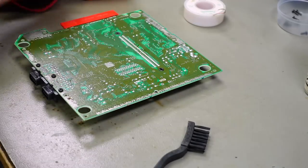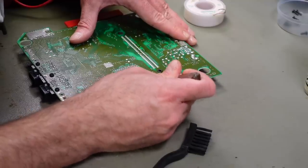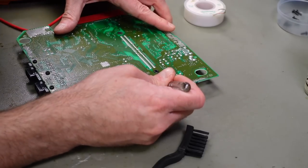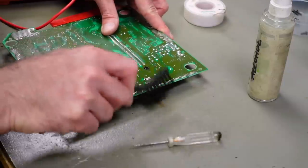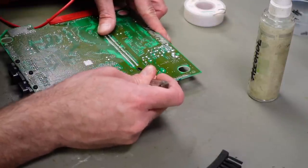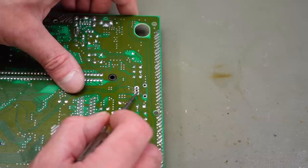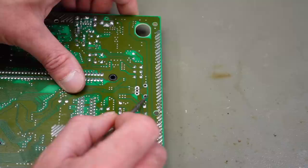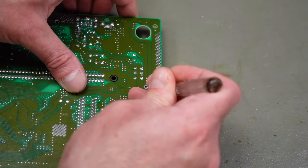Still have a dead short, so I'm going to try scraping the space in between. That's better. There was some bent metal that got between those pins and got into the circuit board slightly. With my pokey tool it seems there was a piece of bent metal from the pad that shorted these two pins together, and now there's no short anymore. There's a bit of a ripped portion on the center pad, so maybe I'm going to add a little bodge wire. The heatsink pads are also connected to ground so that shouldn't be an issue. Now I want to solder in a new voltage regulator.